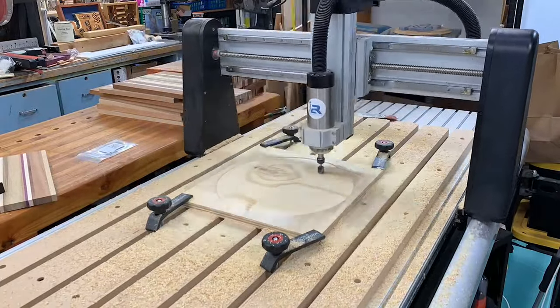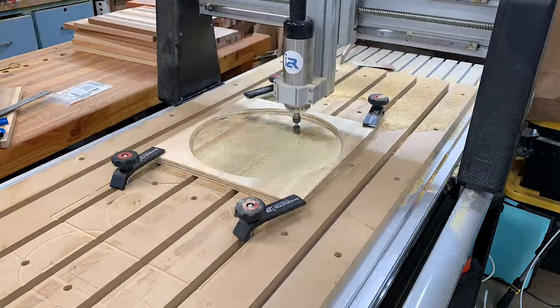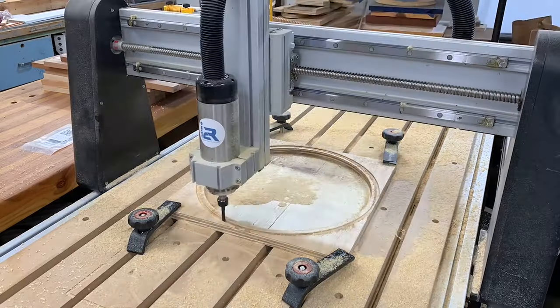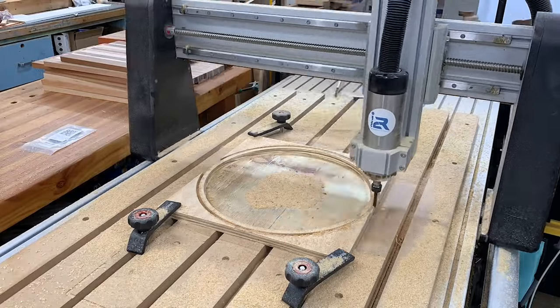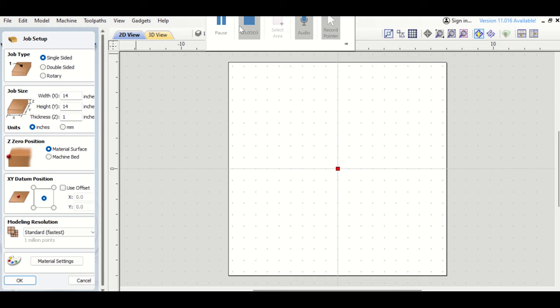Another style: anytime I try a new bit or style, I test it on scrap plywood first. Here I'm using a bowl-and-tray bit to test a round dish with an inset juice groove and an outside profile. Quick V-Carve tutorial: this project is a 14 by 14 inch square. It's a little wider than a planer, but you could surface it on the CNC bed — just like cleaning off a spoil board — for a fully CNC cutting board.